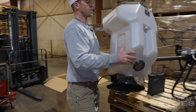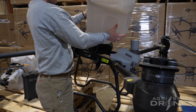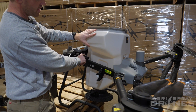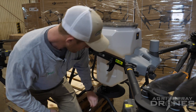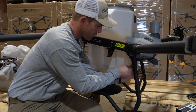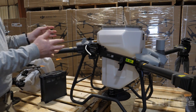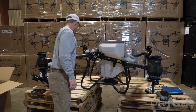Now this can drop right in. The wire goes out to the right side of the drone and it should rest on your scales here, other side in the front. Then plug it back in to the plug that the liquid tank came out of — make sure it clips. Now we can throw a battery back in the drone, boot it up, and get started for the calibration process.